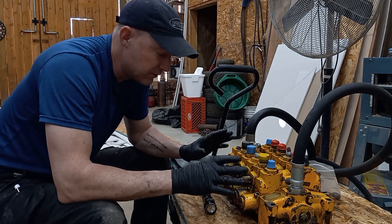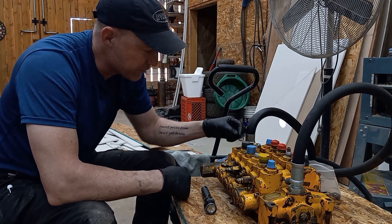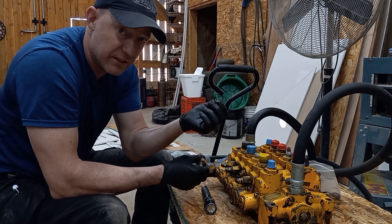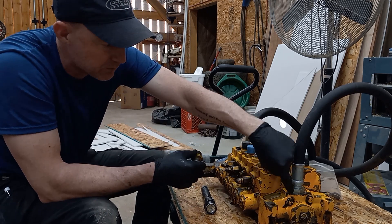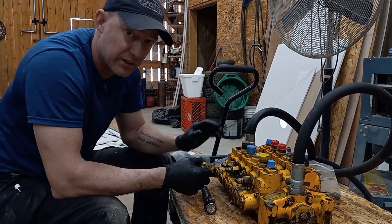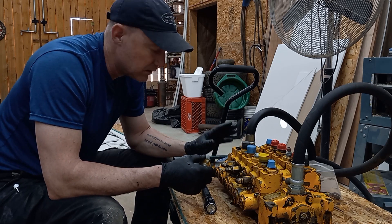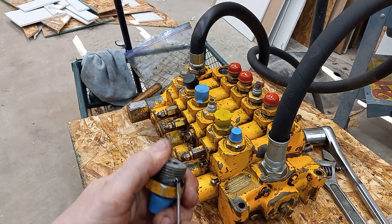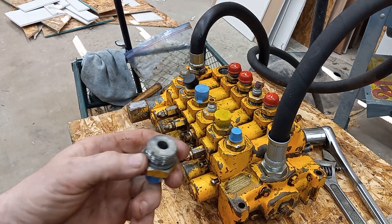On this particular valve body, you've got three different O-rings. The bottom one and the top one are the same. This one right here that seals this piece to the valve body is the second type of O-ring, second size. And the third one is right here on this bigger hose — it's going to have a bigger O-ring in there. Now on both of mine, the bigger ones weren't leaking at all, so I didn't bother taking those apart. If you don't take it apart, less chance of it leaking. I did however, since some of these were leaking, take one of these off, measured it, and ordered more O-rings for all of these. So I'm going to put all those O-rings in after I'm done with all these.